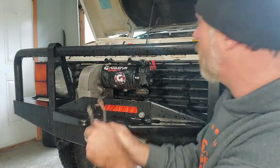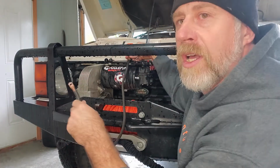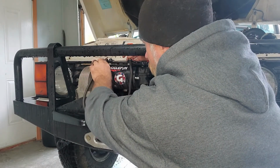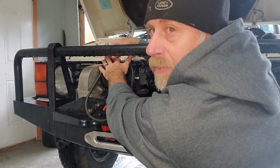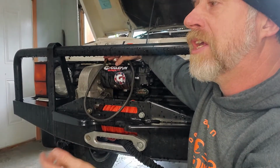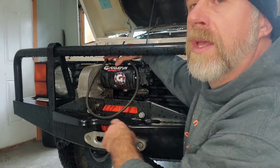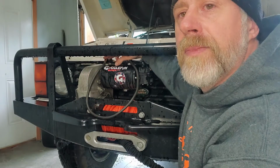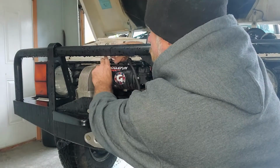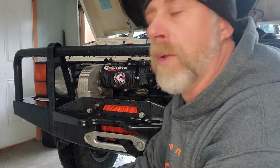Basically, you're taking this and connecting it to the front lug and then one of the back lugs. You're just jumping those together. And then you're putting your battery power on, and that can be done with a set of jumper cables. To do this with jumper cables, you'd have to have 2 different sets. You have one set to jump the lugs, and then the other set to run your positive from your battery to the other lug on the motor. So you're jumping these together, you're powering that other lug. The motor should spin one way.